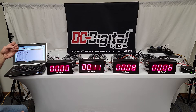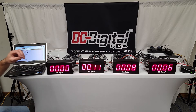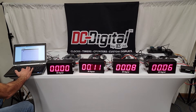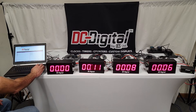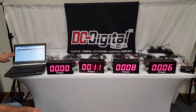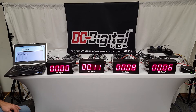To set these up, you take the MAC address, find the IP of each unit, and enter it into the system. You don't have to have a web server one — each timer has its own web page and its own averaging if you want to go that route. But the web server one brings them all together on one page. It supports up to 50 bays, where you can enter an IP address and label them bay one, bay two, service stall, or whatever you want.